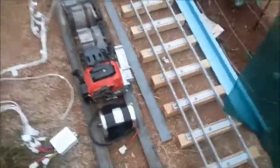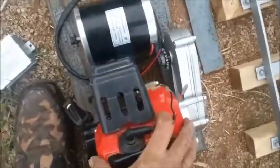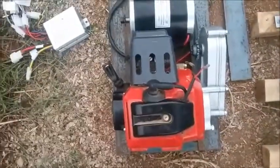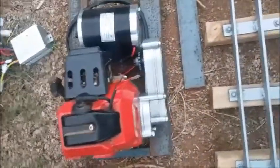For the centre ridge of the NR class — a narrow waist locomotive — we've got the walkways down the sides. This is 150mm, and by the time I add the hinges on the sides to lift the sides up to look inside, it'll work out at 158mm, which is an extra 4mm each side. That'll keep it to scale. The only problem is this motor — I don't want the pull starter or gearbox sticking out, so I'm thinking about bringing it forward so that all of it actually sits inside the cab, within the sides.